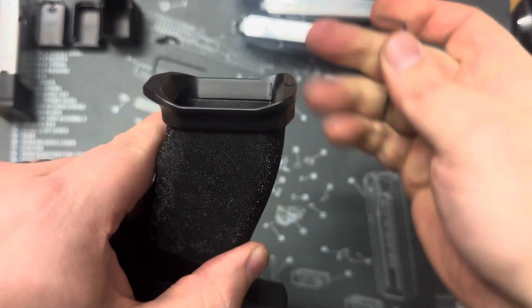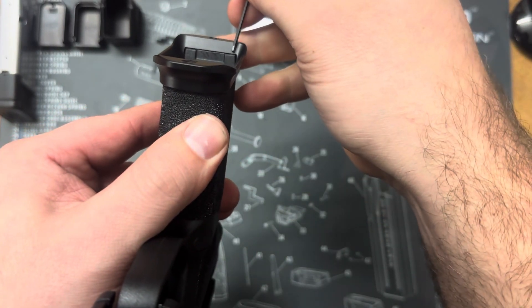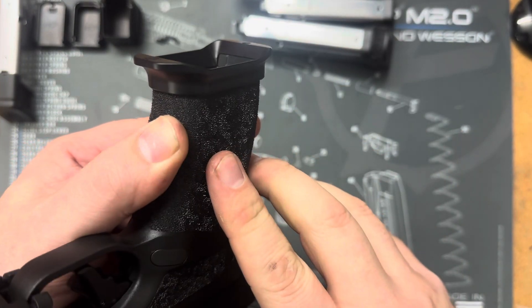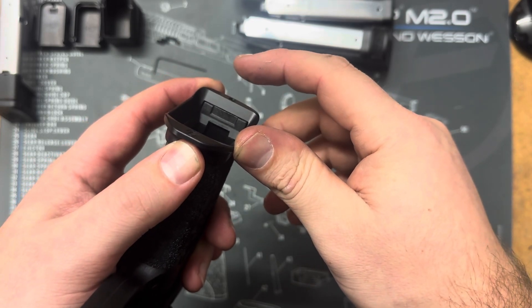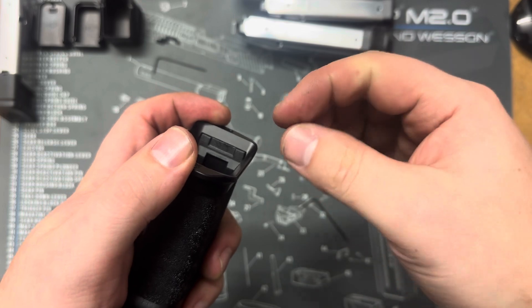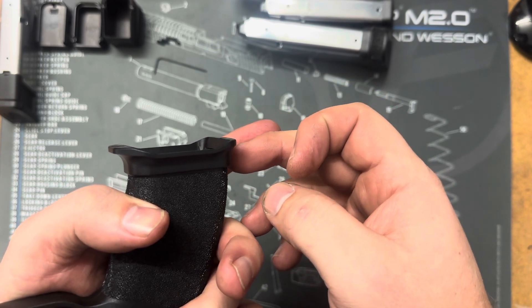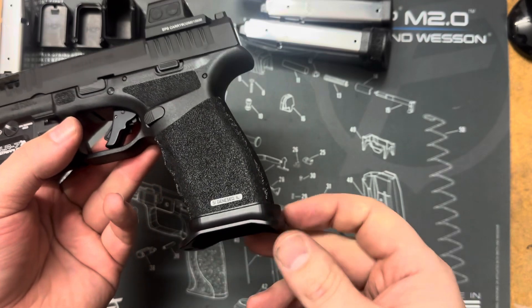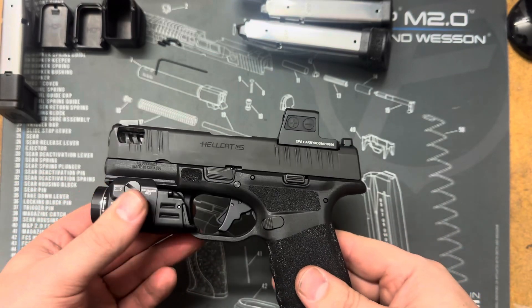Check it really good — that the front and the back, that there isn't a big gap in the back, and check here too, that this mating surface has no big gap there. This looks pretty good. If you do have a big gap in there, bring the set screw out, re-hold it down and try to put it back in. Try not to do that too many times, because as that set screw goes in, it gouges the material and pushes it away. Too many times on and off could actually wear out the material to where the set screw won't hold, and then you'd need to build the material back up with a soldering iron or it might not hold anymore.